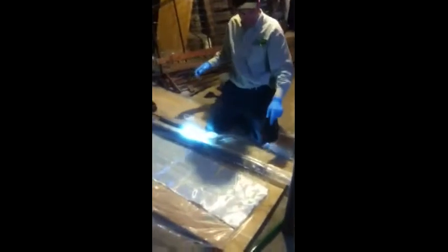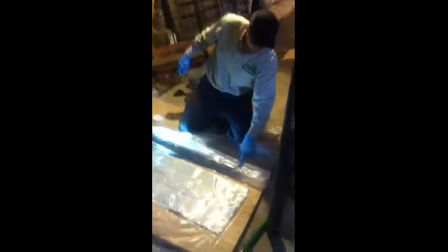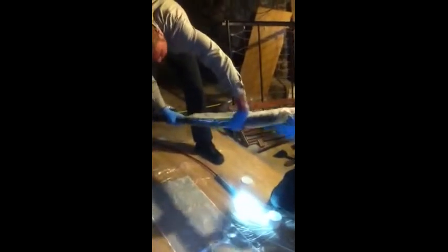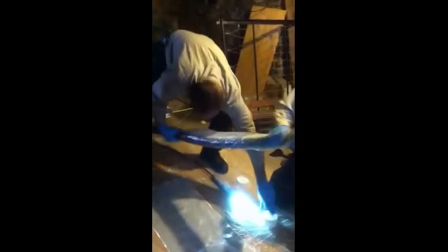And what we have done is we pre-fit the bladder inside the bladder protectant sleeve, and we pre-marked with a Sharpie where we want the metal ring to be, as you can see right there. And what we're going to do is once we lube up the bladder protectant, we're going to put zip ties on the end of it. So when we pull the bladder back, it's going to turn inside out, still stay attached to the bladder protectant, and then pull the bladder protectant sleeve out.